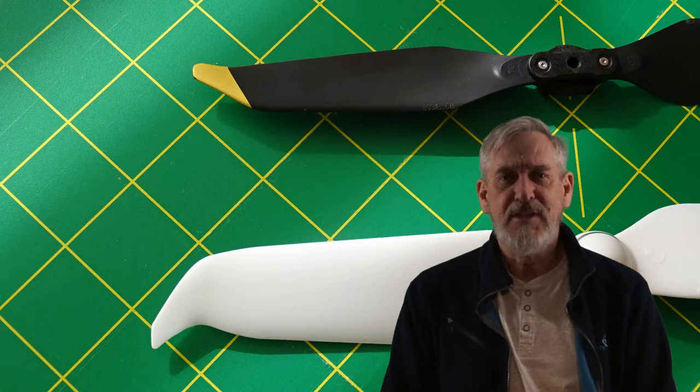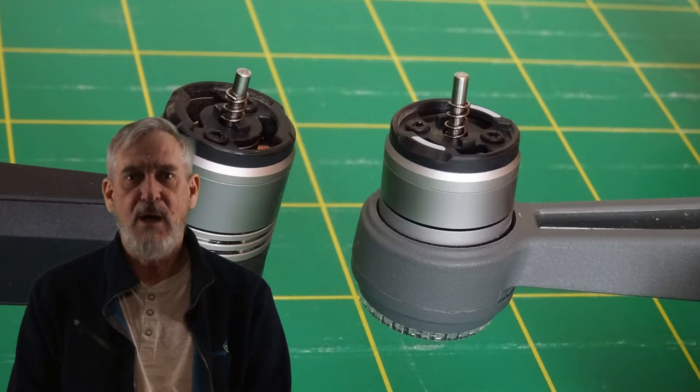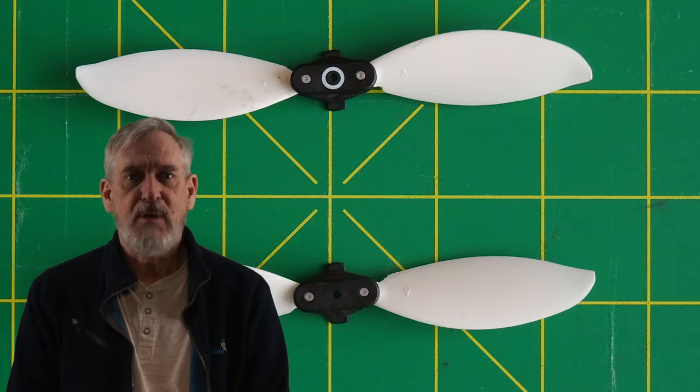Sadly, DJI has made no low noise props for the Mavic Air or Spark. These two UAVs have higher RPM props, and the frequency of the sound produced by them is much more annoying. Surprisingly, the Mavic Air and Spark use the same prop mount. There have been others who've made props for the Mavic Air using Spark prop hubs and Anafi blades.